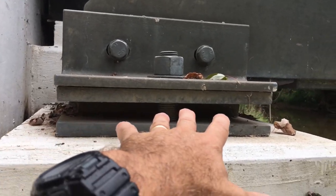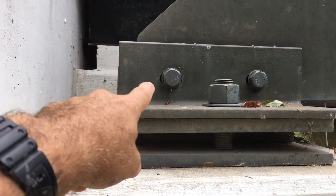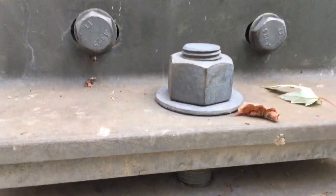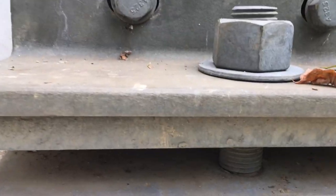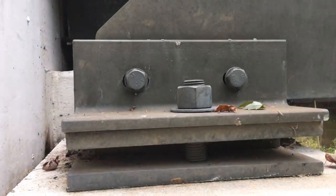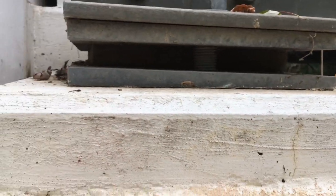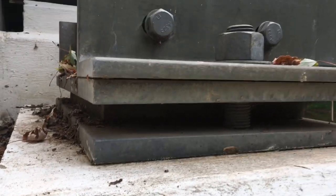Just like the beam bridge over the Monocacy, it has a slider but not a roller. You can see the little spaces on each side of the bolts — it allows for very small movement, the expansion and contraction. This bolt doesn't hold it down still; it's got sliders in there. Not enough space for the bolt to move back and forth, but it looks like there's a plate underneath that allows for it to slide. Possibly it's asbestos — a material that's rough on people, cancer-causing.